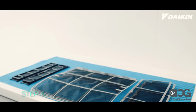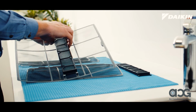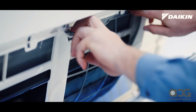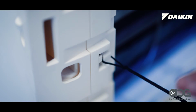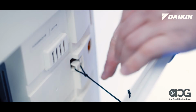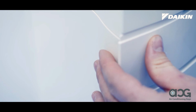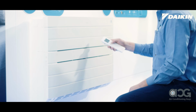Now that the filters are clean, reattach each one, starting with attaching the air purifying filters to the lower filters and then sliding them into place, followed by the upper filters. Carefully hook the securing strings back onto the front grille and then close the front panel. Be sure to lock the front panel into place on either side of the unit by sliding the locks down. Now you're ready to use your Daikin split system.